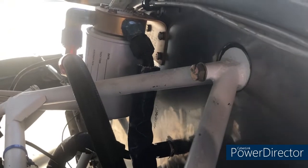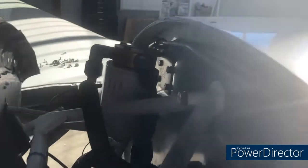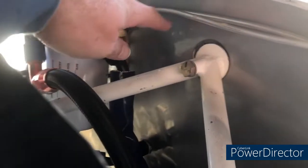On this one — Cozy Girl's mount — they chose to put a 5th mount here just to do some extra stabilization. I don't know how much good it would do if you didn't reinforce that. I've reinforced this up here on the inside and outside. This whole area is reinforced. And then right here along the window line, all this comes all the way down. I have several layers of bidirectional cloth from the top all the way down to the top of the strake on the outside and the inside to give it strength. I also have probably a 6-inch square of several plies of bid on both sides there.